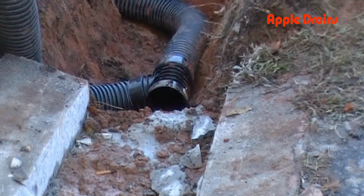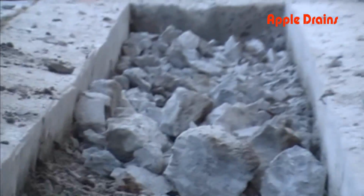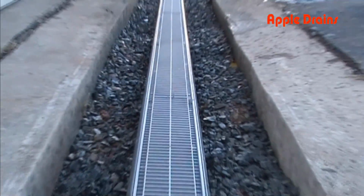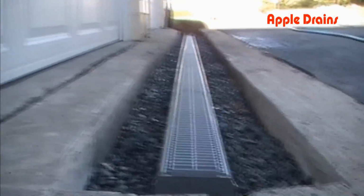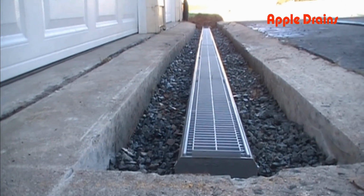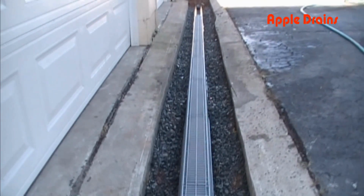Now you're looking at the discharge of the channel drain where it exits. Here we've got the bulk of the concrete removed. A little bit of rubble left, we'll clean that up. We've laid out our channel drain, surrounded by gravel to give it a good base. And next we're going to start pouring the concrete.